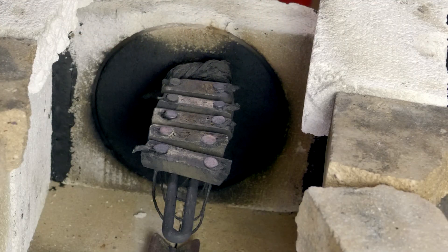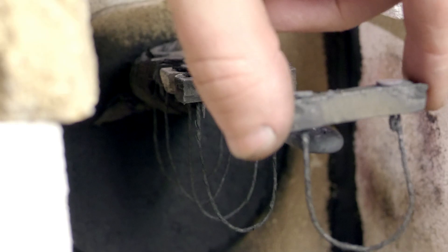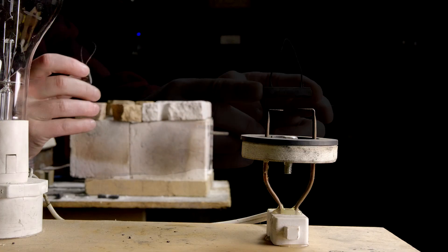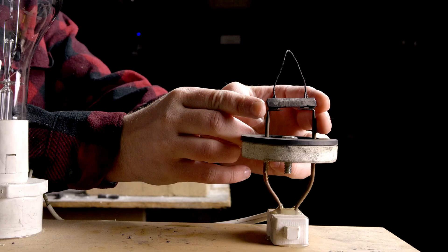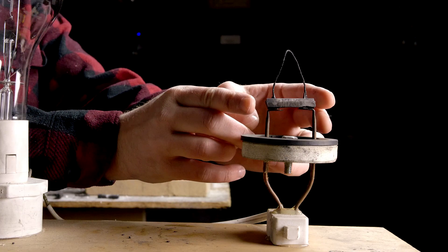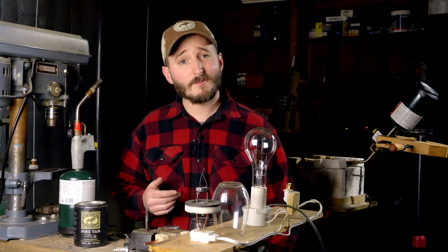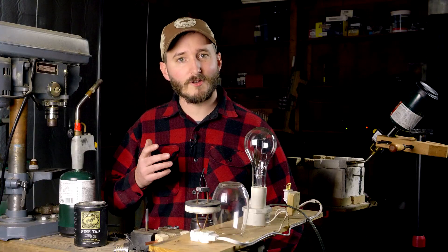You can see how fragile these filaments are, which is why the ceramic base was necessary to move them around for testing. Each filament is carefully taken out of the carbonizing chamber and moved over to my test stand, where it sits on two exposed pieces of copper, which makes contact with the nails glued with carbon putty into the ceramic support and to the now carbonized filament. There's one last thing to do before connecting the power: the filament needs to be protected from oxygen so that it doesn't catch fire and burn away the instant it's turned on.